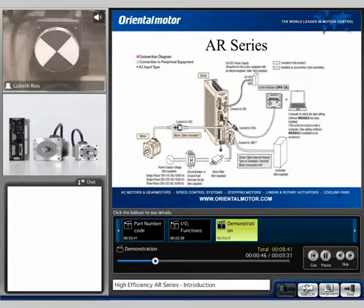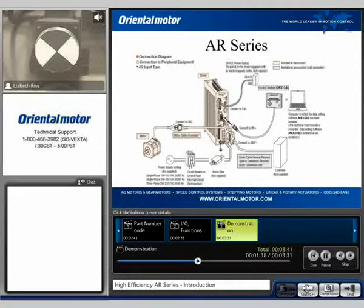I can go ahead and run a basic motion profile here. In this example, we see the motor move the distance of half a rev — 500 pulses — and then it moves in the counterclockwise direction a quarter of a rev, and then it moves in the positive direction an eighth of a rev. After the loop statement, it then moves to the absolute motion of 30,000 pulses.